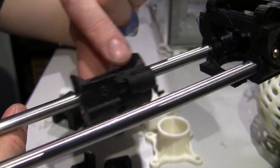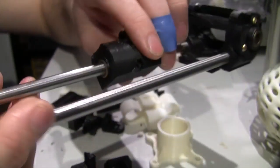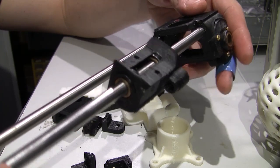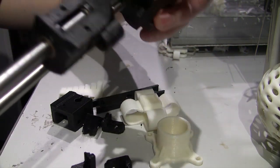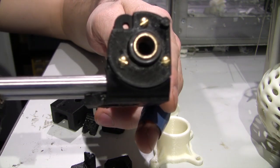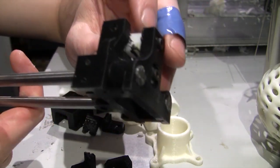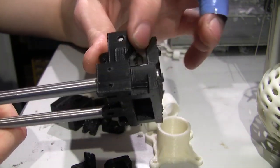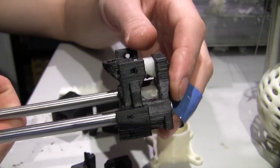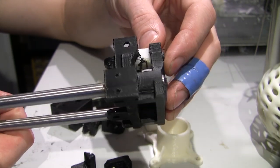Now I am also not impressed with their brass bushes in here. As you can see, they've got brass bushes just about all throughout the printer. It was brass bushes, which again, and there we go, there's some more brass bushes there on the carriage, and this end had Teflon. Now this ran with the bar through there, and there's a Teflon piece top and bottom, so this is not even a bush. And this was so loose it was flicking up and down by like half a centimetre when I received it.